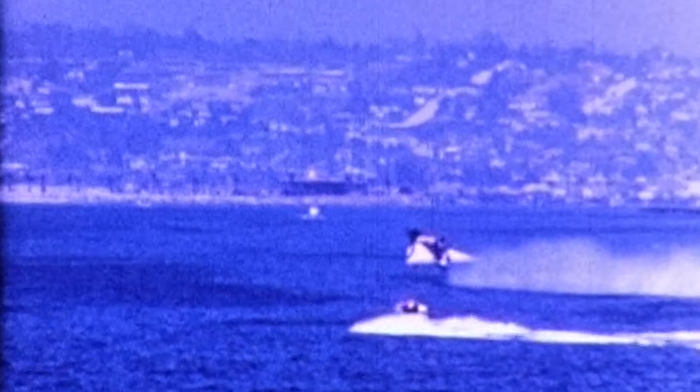From 30 knots to 50 knots is the third and final stage of the acceleration. This is where we extend the oleos at 30 knots, which allows the ski a greater angle of attack and more hydrodynamic lift. We're able to raise the tail out of the water, get to 50 knots as the drag is heavily reduced, the acceleration should be rapid. Get to 50 knots, rotate to 18 degrees, and get airborne. Those are the three acceleration phases of our Convair Sea Dart, just like the full size.